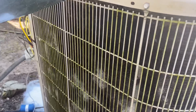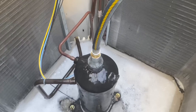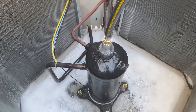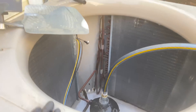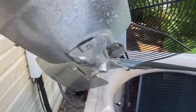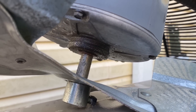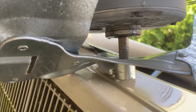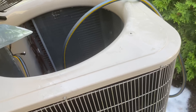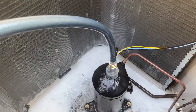Got a little bit of water on there from when I was washing the coil down. We'll put a little mark on there with the Sharpie - today's date - so any future service technician, not my company, at least knows what's going on. We have successfully washed this condensing coil - much better now. Got a little bit of moss on there, maybe we'll get the brush and clean that off. Right now I have the cool presser on to cool off this compressor, get her out of thermal lockout and get the system up and running. One thing I didn't do was spin the condenser fan motor - yeah, she spins freely. It looks like she lost her load right there - she's leaking the oils. So this condenser fan motor is not going to have that much longer to live - it's a sealed motor, so when you leak out those lubricants, no bueno. Probably because it was overheated because we had a bad dual capacitor.